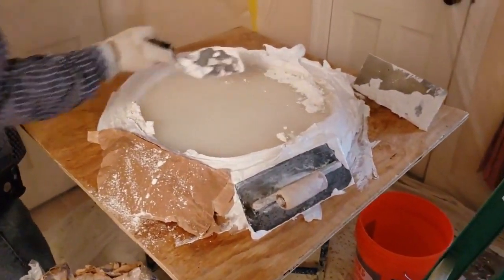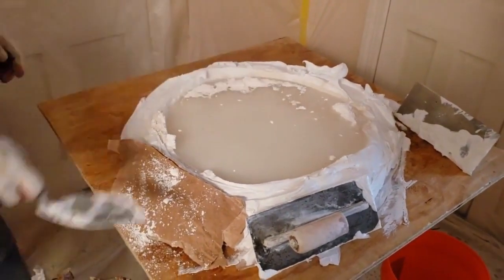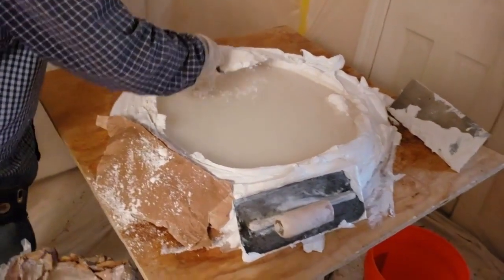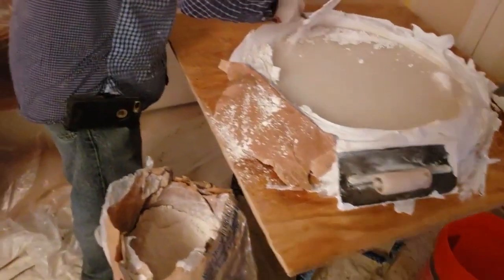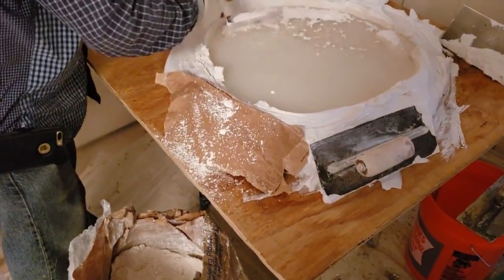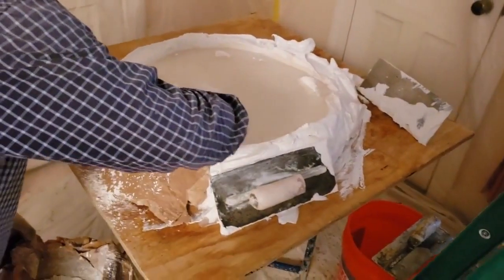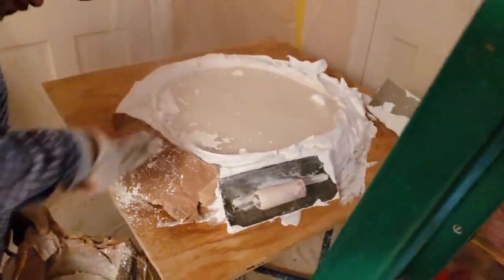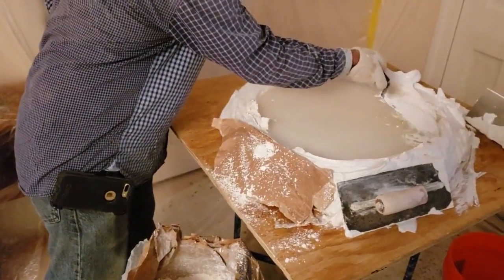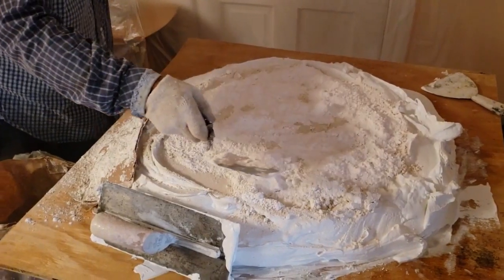We're using both molding plaster and gauging plaster. Without molding plaster I'd use gauging plaster, but the advantage of molding plaster is it tends to be a little harder and has a finer grain, though it floats more in the water than gauging plaster does — they're about the same overall. Molding plaster is made for moldings and it gets really hard. If you let this patch sit for three or four days it's going to be really super hard, difficult to scratch — a very solid, durable patch that should last forever.